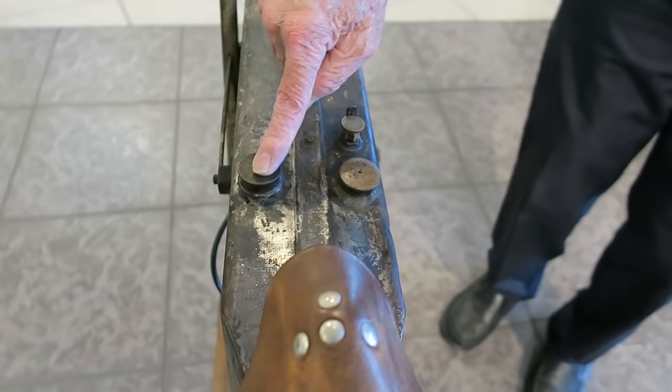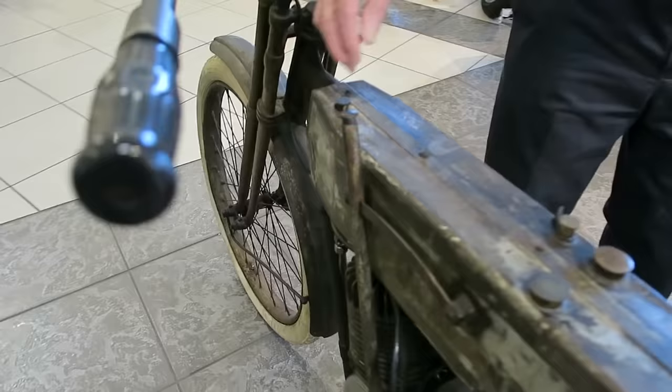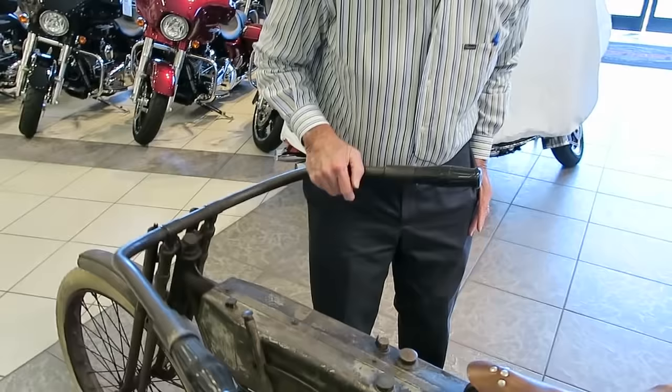You put the oil in here, and you turn this little valve on. There was a sight valve there underneath, just like the old tractors used to have. 6 drops a minute is how you ran it. When it got too much oil in it, if it did, it would just blow it out the breather. So that was the oil.